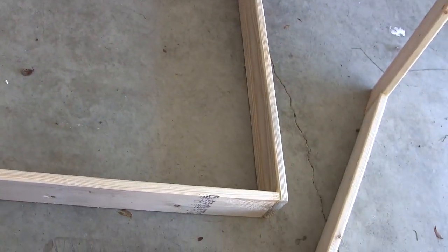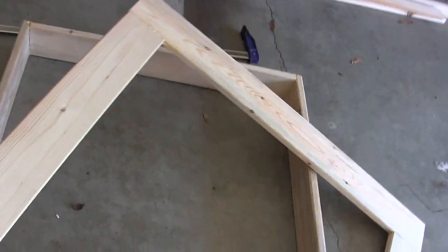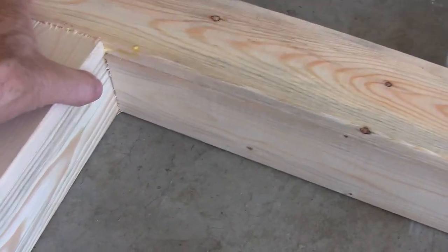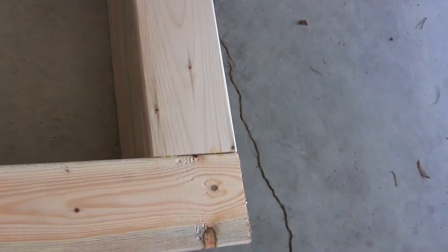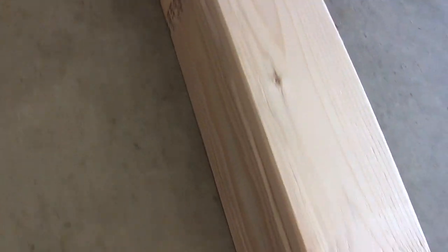The frame is finished drying enough that I can work with it again. I'm going to place this other frame on top of it — everything should fit just right together if I did everything properly. I'm going to glue all the way around this connection where I'm joining the two frames. I'm also going to put some brads in there, mainly because I don't have enough clamps to hold all four sides equally, so I'll use brads to hold it down while it's being glued.